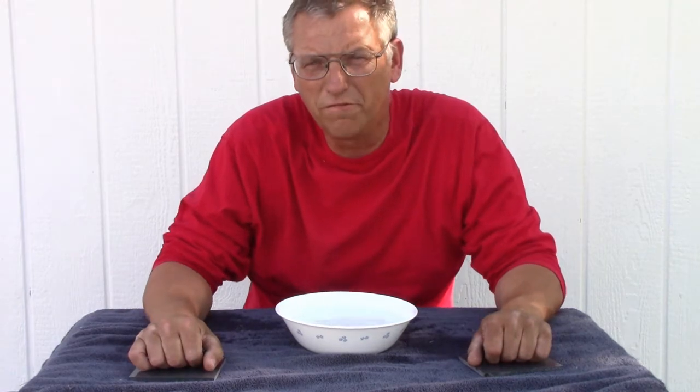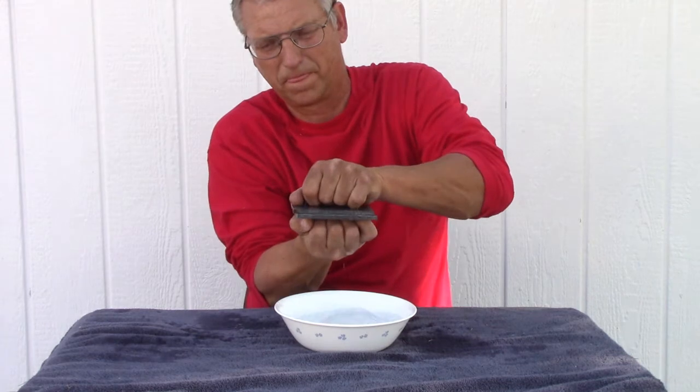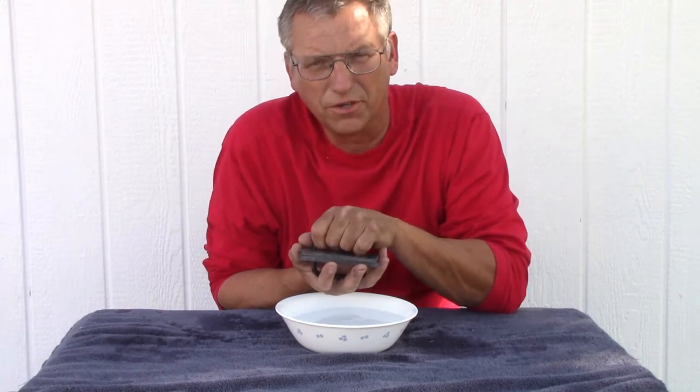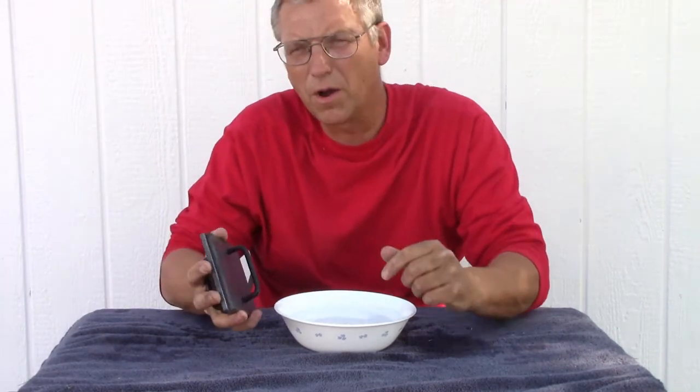So the question is, what kind of crazy voodoo is going on here to make this happen? There's no voodoo — it's just science. This is how we normally think of water: it's a liquid. But if you squeeze water between two plates into a thin film, it acts completely differently. There's no flow, but the two surfaces have almost no friction. The hydrodynamic seal — super slippery, no flow. And this is the property of water we are exploiting for our shallow well AK pump.